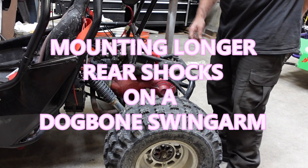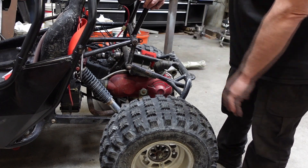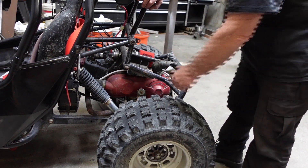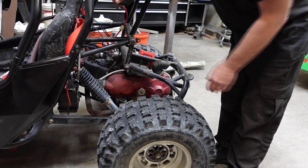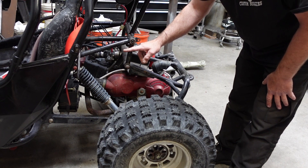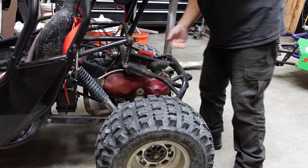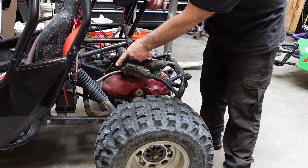What's going on today guys, JD at JD's Custom Buggies. What I've got here is an American Sport Works Carbide — it's one of the race machines, number 07. Last season the owner made a shock change, but what he didn't take into consideration — what you have to be careful with when doing a shock change on anything with a dog bone — is if you notice the dog bone sits static almost vertical, and when that happens, this is what happens: it overextends, the motor can pop up and